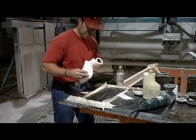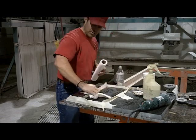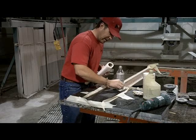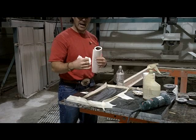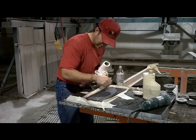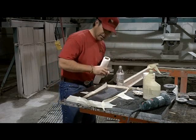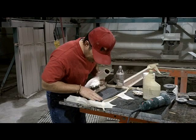I usually like to give some hints, like do this many passes. The problem with this process — especially for the first initial ones — is that how much time you spend on your 200 grit is really going to be a function of how much of the surface you have to cut down. So that you get everything to where it needs to be — meaning flat, your scratch is gone, your seam is smooth.